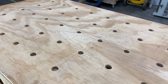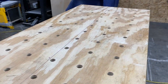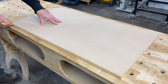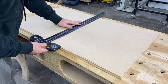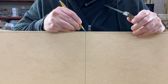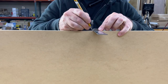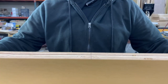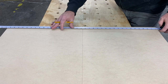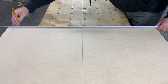Another way you can address this is by using two tape measures. Start by marking a straight line on your work surface as a reference. Next, draw the baseline of the arch on your piece, then draw a center line that is square to the base. Also square down the front and back edge — this is done so you can register your material on your reference line. Then mark 8 inches up on the center line for the rise.